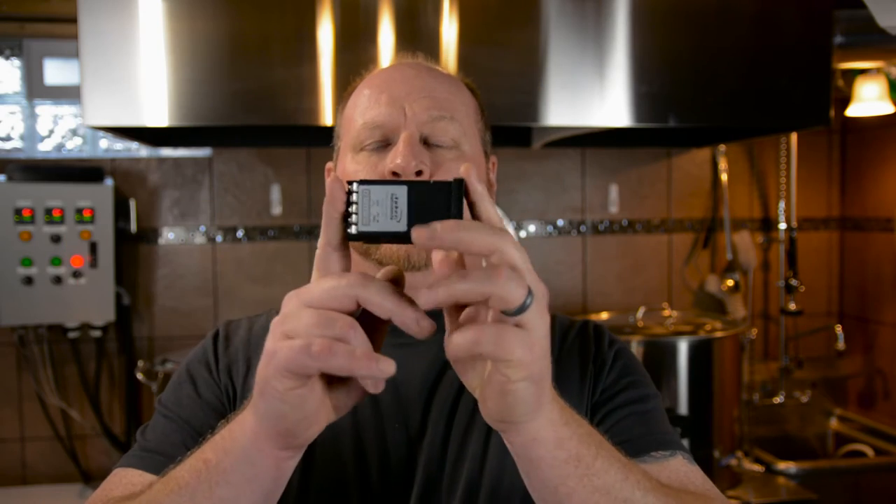One of the other things to consider is the depth of the panel. The PIDs we're planning to use — the DSPR120 and the SYL 2352s — are fairly deep, about four and a half inches, and that can come into contact with components inside the panel if you're not careful. There are some contactors listed in the build, so you want to make sure that you have all items specced out and won't run into any issues when you begin installing components in your panel.